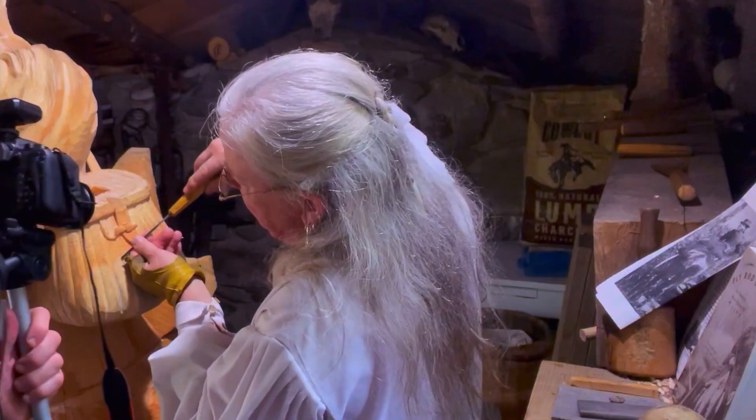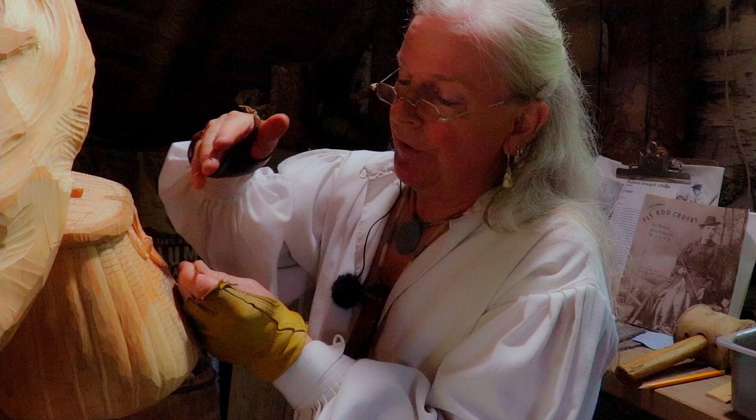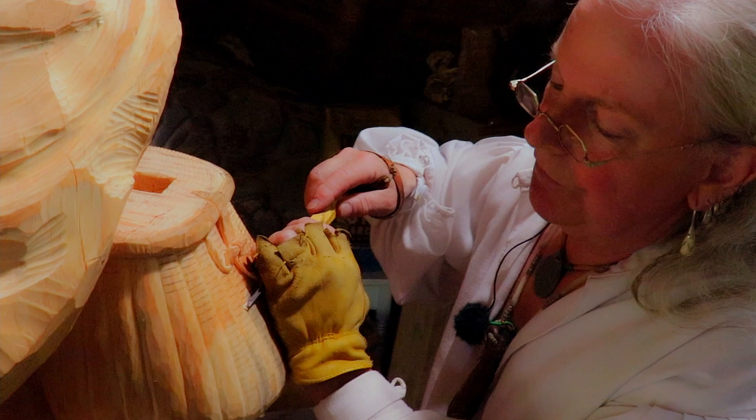The trouble with this little V-gouge parting tool is the sides are fairly short. It's not too difficult to get that corner underneath the grain. You can see on this last little attempt, which isn't ideal — it tends to pull the grain up. But if you don't let it get too far ahead of you, you can correct it.